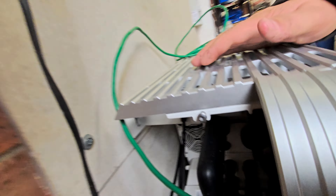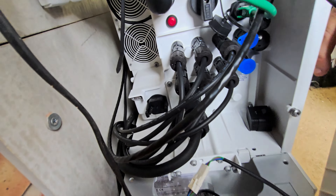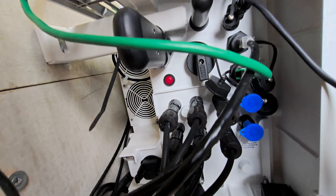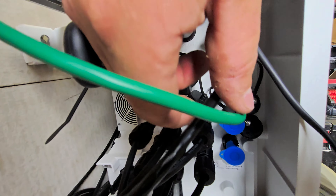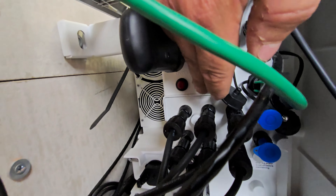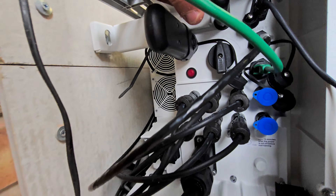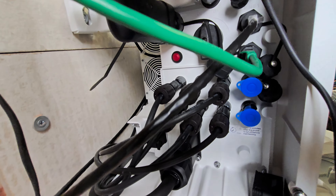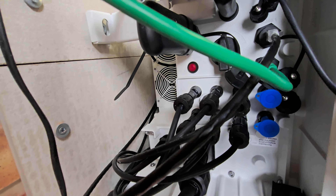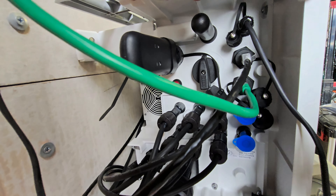In the SIG inverter, you can see it's got four inputs and four MPPTs as well, so these are really flexible. This is a 10 kilowatt variety — I think they go up to 12 at single phase level, so they're absolute beasts. We've got our LAN cable here and the link over to the gateway. We've got the lights which wire in on the side. We've got our DC isolator that's built in — as you know I always fit external ones as well. We've got the AC on/off button, 4G dongle, a Wi-Fi antenna, and the main power port. So you can see it's a combined wiring centre for all AC and DC — comms on LAN, Wi-Fi and 4G, which is super handy.